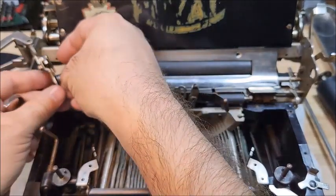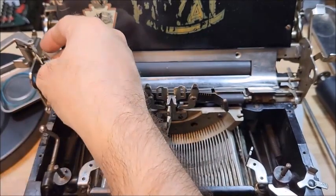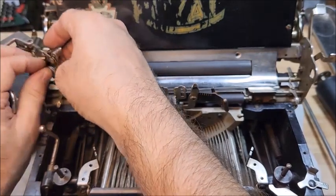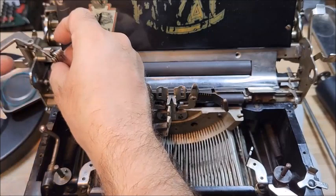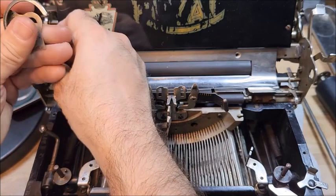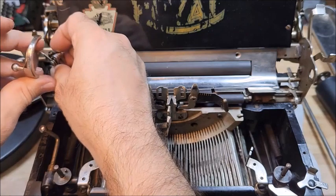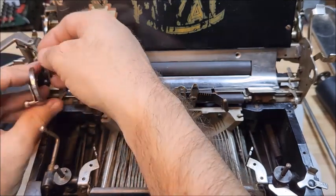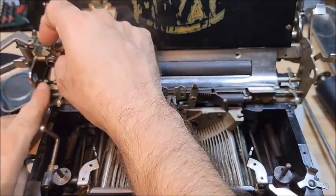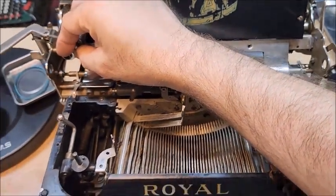However, that presents a little problem. So put this back on. First, you put the collar through the ratchet. Then you put the spacer on. And the spacer pushes the ratchet up against the right side here of the line space regulator. So you notice I've got a hole for the regulator here, and then there's a little ring that sits above the gear, and this is offset a while. You'll also notice these little bits here, they hook onto that spring right here. Zoom in so I can show you.